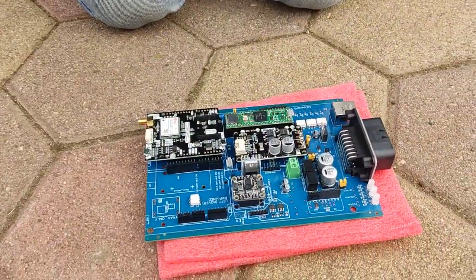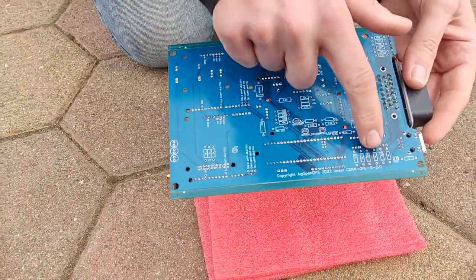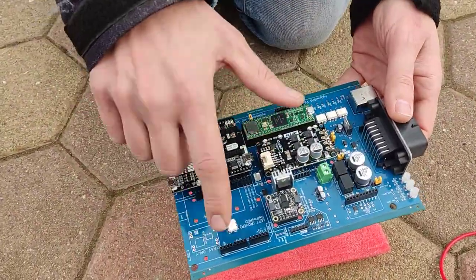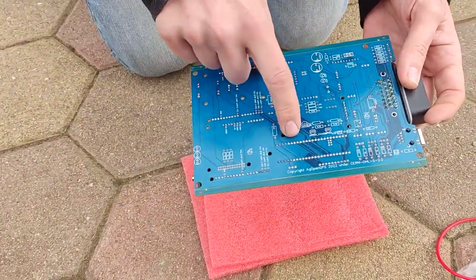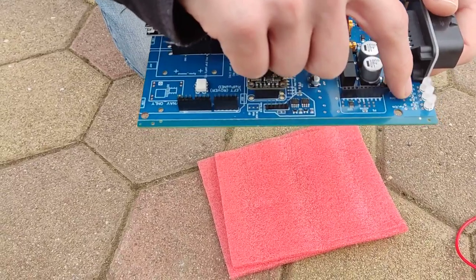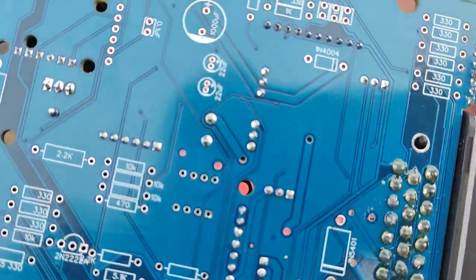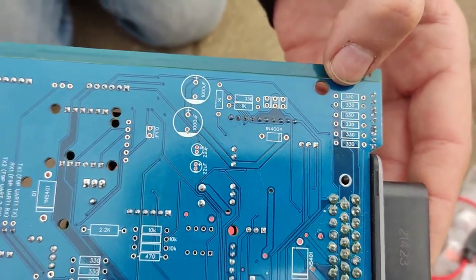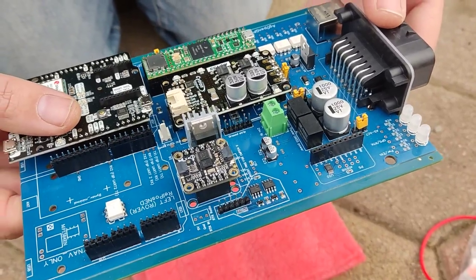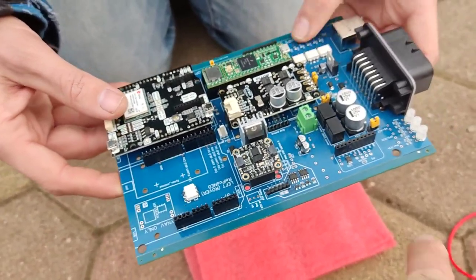Let's talk a little about the function of this board, which is not everywhere stated. If you are ordering a board for yourself, there's always confusion about whether to assemble just the top or both sides. The bottom side has through-hole components which you can manually assemble. The top side has small resistors — the same resistors on both sides. The bottom is easier to do by hand; the top can be done by machine. So if you miss some component, you can leave it out from JLCPCB and then do it yourself on the back side.